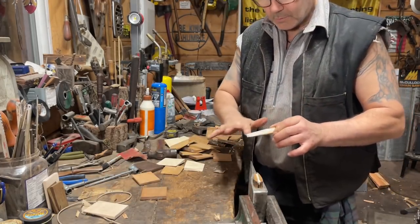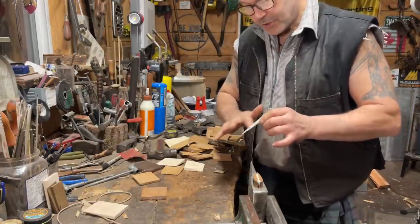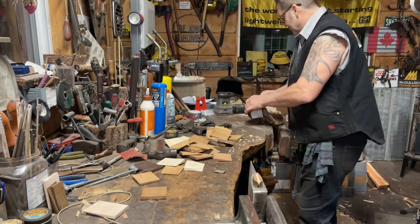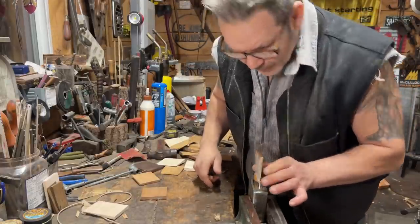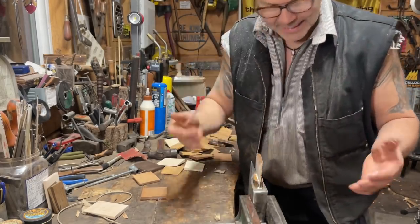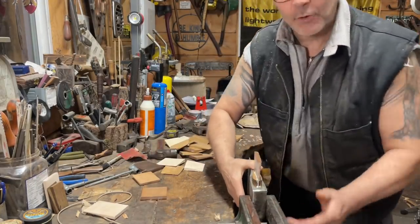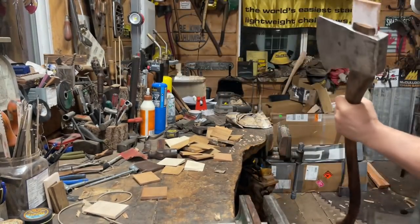Hey, are you guys and gals and women and children ready for this one? I think he is ours. I know I am. And I've got my wedge shaped a certain way because of how the haft went. And we're going old school on it. We're putting this in here like this. Yes, indeed we are. We're going to start it. See how it started even? It went down even. It didn't give me gears because this back end, friends, was tighter than the front. Do you know what I mean? Look at that before you start banging wedges. This is what I'm talking about. Look.